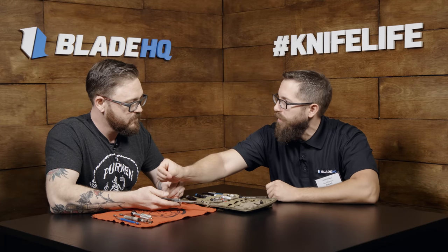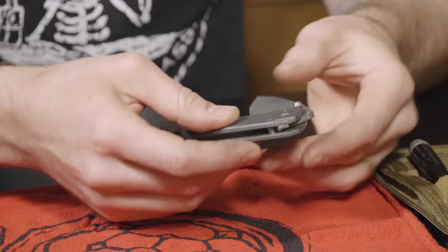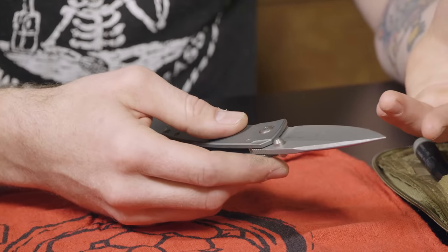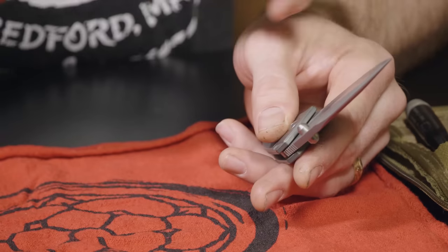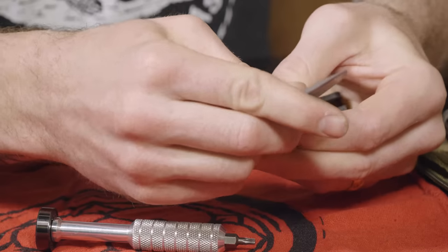Let's look at just the adjustment of the pivot. If I was going to adjust the pivot, do I want to get on here with my tool and spin it three times? When I'm tightening pivots, I always start with the blade a little bit — about three quarters closed — because you don't get a true adjustment if the lock's engaged. So usually right in there. Always use good drivers; having Wiha bits or something hardened is really good. Everything should always be supported, because if you're in a hurry and you slip and put too much pressure, you're going to put a big gouge in your knife.